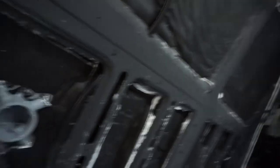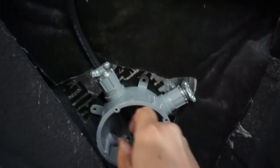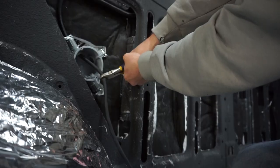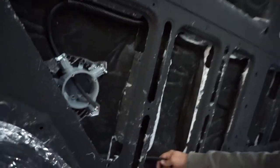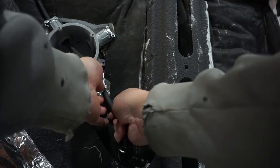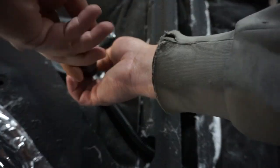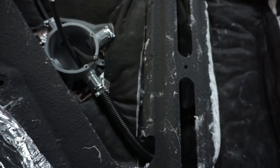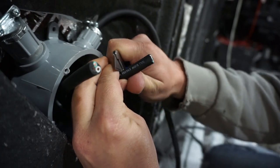With the loom in place we shove our wire straight down through it and we're ready to plug it into our junction box. With the main input wire through our Romex lock connector, you can pull the wire in and it cannot be pulled out of the junction box. We cut off the excess, bring the output wire up through its lock, tighten it down, and now we have two wires locked in, all conduited and ready to go.